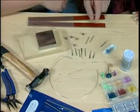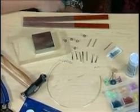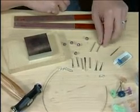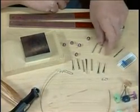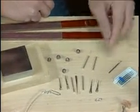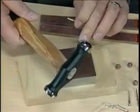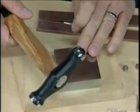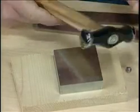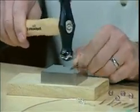And then we got some really thick 10-gauge wire that when you forge it out, and we're going to be doing forging today, you could get some interesting shapes that way, and then string them on the wire. Absolutely. So I've done some pre-shapes here, and how that's done is you take a length of 10-gauge, however long you want it, and you're going to alternate flat areas. You want to use a polished steel block to do this on, and a polished forging hammer. These ends are highly polished, but there's a flat one and a round one. You start with the round one, and that causes it to spread out.